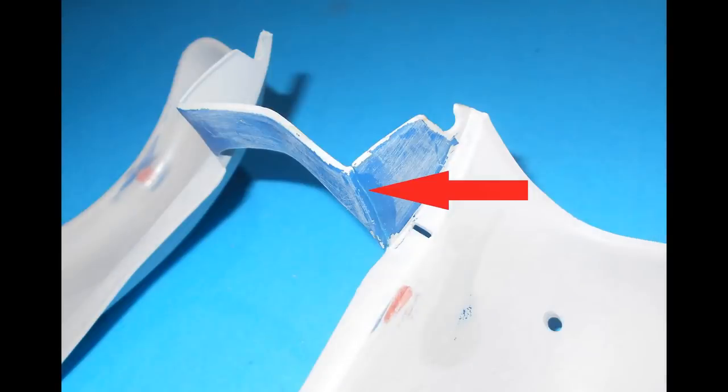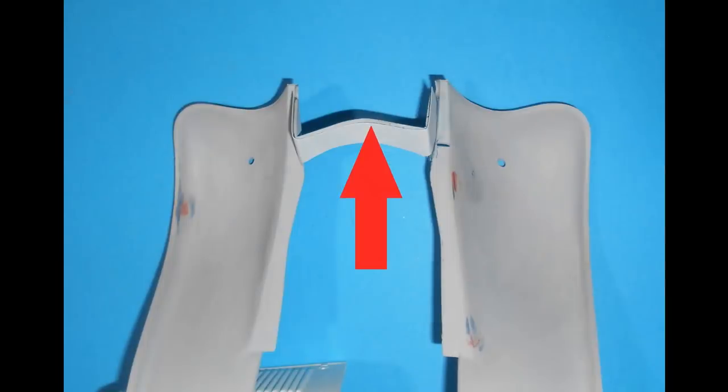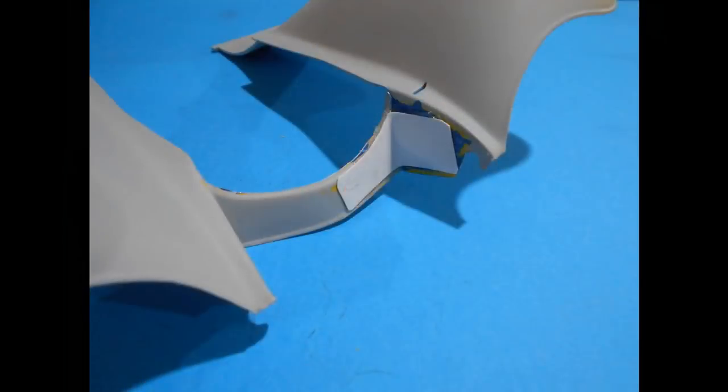After some test fitting, the joint was cleaned up. You can see the super glue around it, but it's nice and clean and smooth. And we're going to then apply the plastic sheet stock with some super glue into position to give that at least a little bit of strength on this side. On the other side of the joint, I elected to use some of the sheet stock and epoxy glue it into position and thicken that up pretty nicely so that it had additional strength.